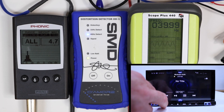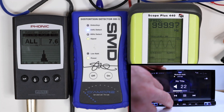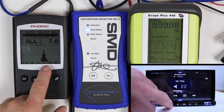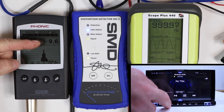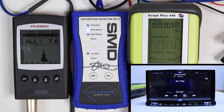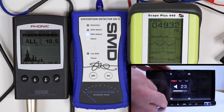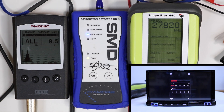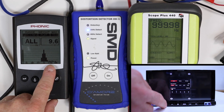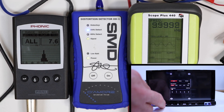40 hertz deck power, Bluetooth: 23 at 9.5. At 23, we are getting a little bit of static right here, so we're going to call that 22. That's only going to give us a 7.6 volt output. HDMI input deck power, 40 hertz: 23 at 9.4 volts. HDMI 1000 hertz deck power — there's that little fuzz again. So we're going to have to call it 7.6 at 22.